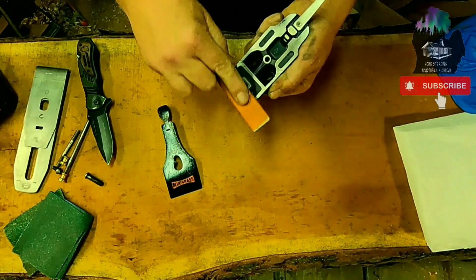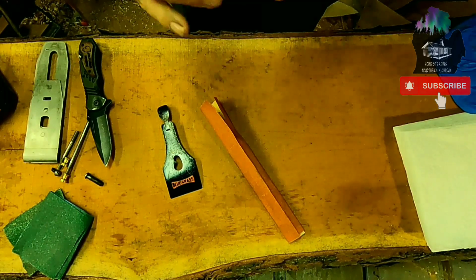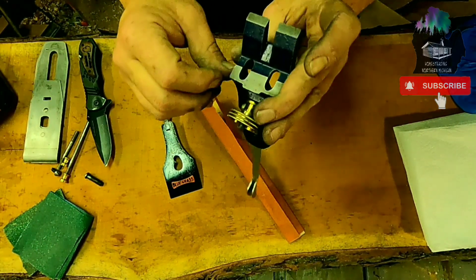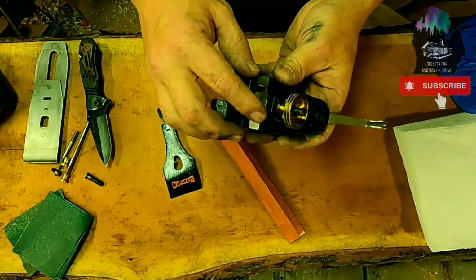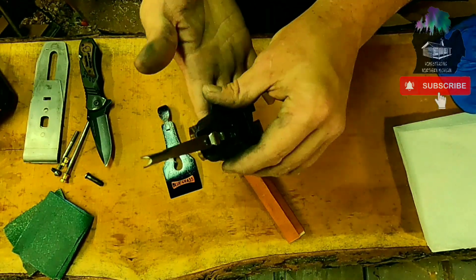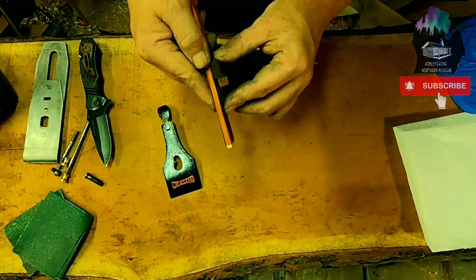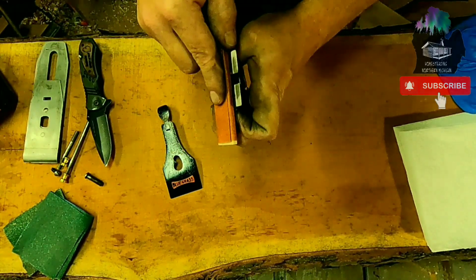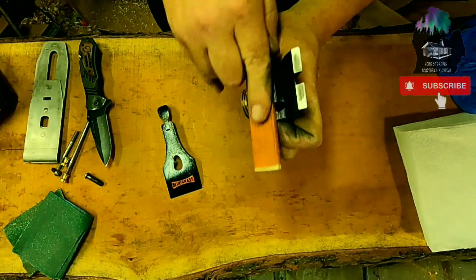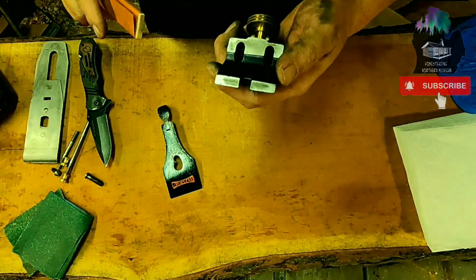So, next, where did I see those? There are some bumps here where the part got tossed around probably before it was put on. All those will elevate it off the bed and make it sit crooked. You got to make sure this is flat and at the right angle for the bottom, or else you're going to make the problem worse. And I did hit that edge a little hard just to knock down that bump.